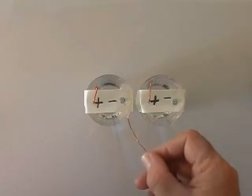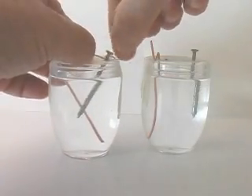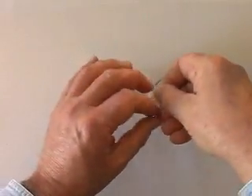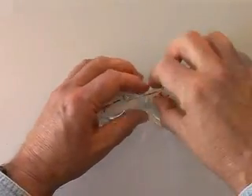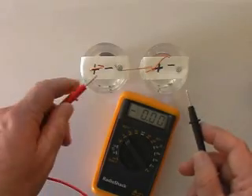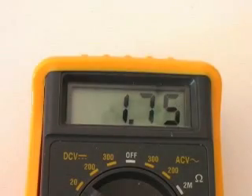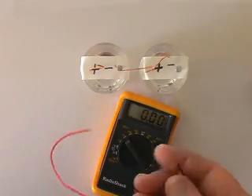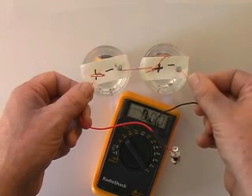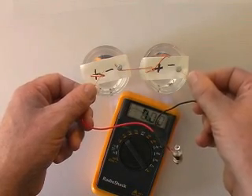A series connection requires connecting from minus to plus on your battery. We'll use a little piece of copper wire — wrap a bit around our nail, then take the other end and wrap it around the copper on the other cell. Checking our voltage across here: there is the plus end and there is the minus end. We now have 1.75 to 1.76 volts. Let's try our bulb now — no glow at all. The problem is, even though we have the voltage, we don't have the current. This battery won't create enough current or amperage to drive a bulb like this.